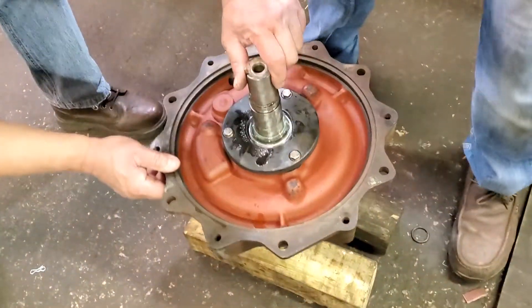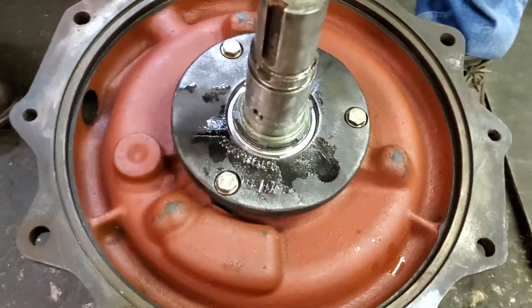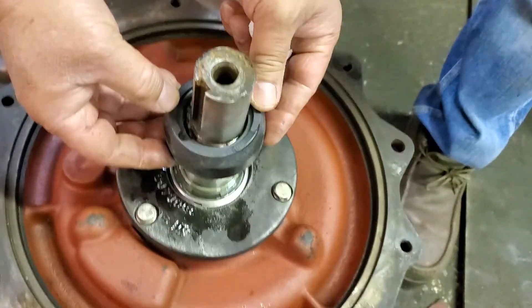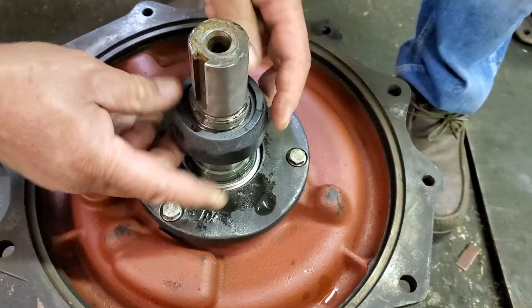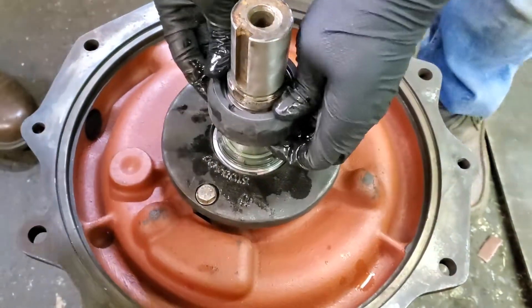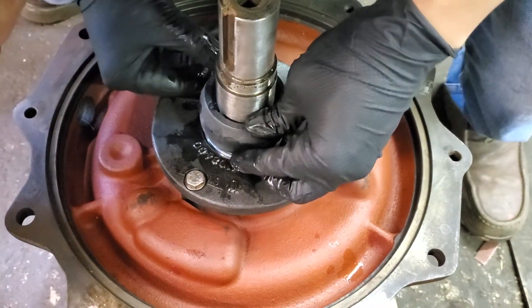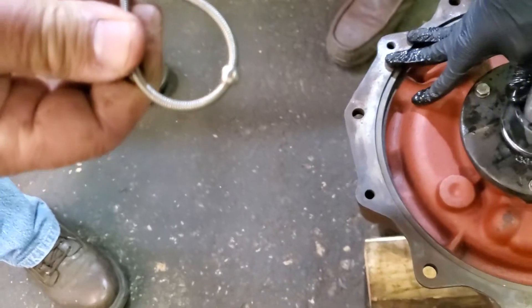Hold on, let's just see. You see a little hole right here? On this pump, it has to go with the little hole on the seal holder right here to go in there. So you see the little hole? The holes have to be lined up. They have to be lined up in there — for the little ball and the spring to go in there to hold the seal in place, right here.